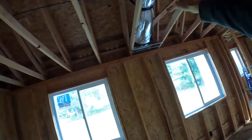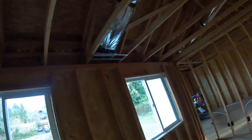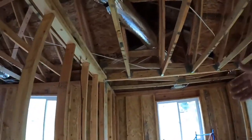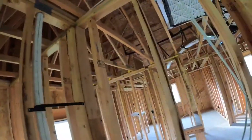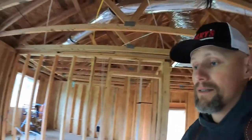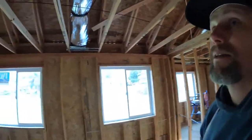Ideally, where all the supplies are is the source of the cold or heat — to heat or cool it before it gets into the main part of the room. So most ducting is near the windows. This one here is near that window in this bedroom. It only needs one over by the window, and the same with those bedrooms over there — over by the windows.